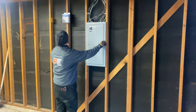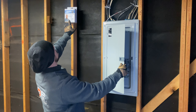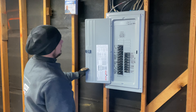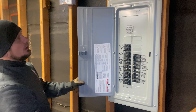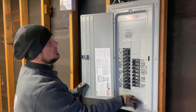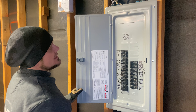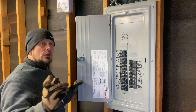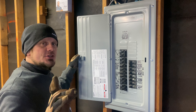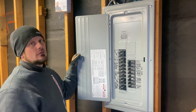We're all upgraded. I left my surge protection device so my customer can put the warranty in for it if they would like — the paperwork is inside there. So this is now the sub panel, no longer the main panel. I did mark that it's a 1-ought aluminum SER for my inspector. Knowing you electricians, NEC 310.15B — you cannot assume a sub panel is derated.